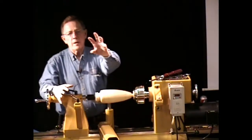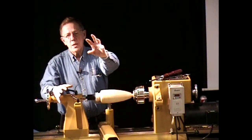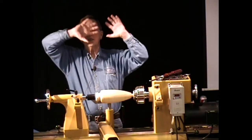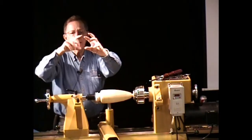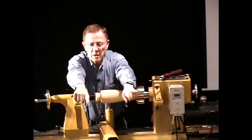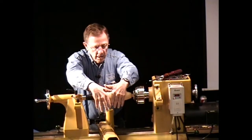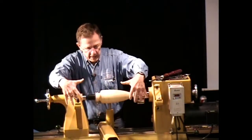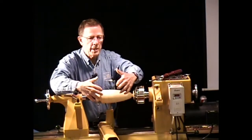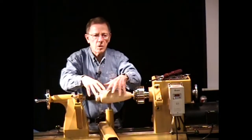The end of a dust collecting hose doesn't collect the dust from over there. It collects the dust from a ball shape that has a center in the end of that hose. So I don't need to collect that air from back there. When I put this piece of plastic up here, I cause all of the air to come from here. None of it can come from behind. This is where the dust is, and it all goes in there.